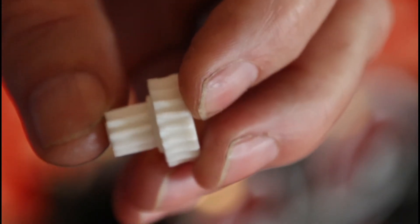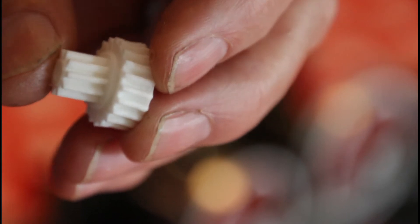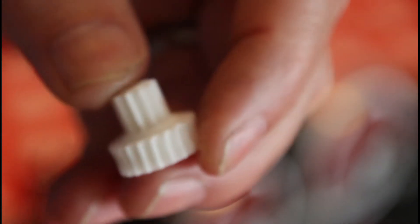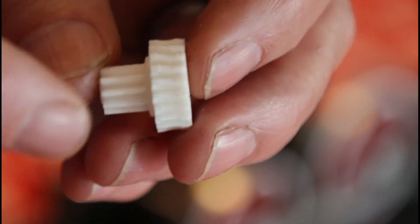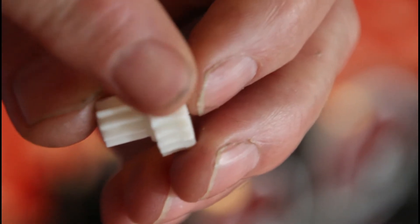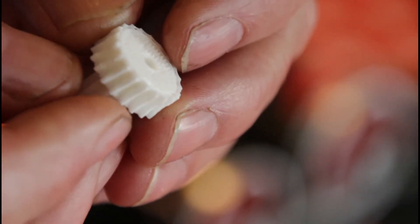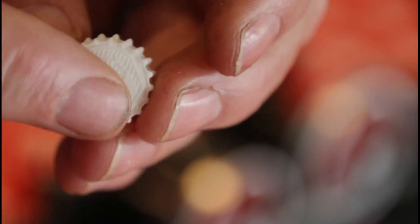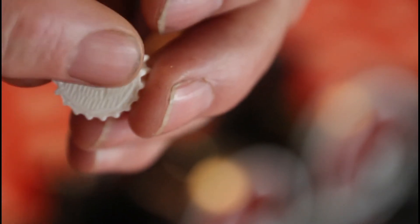It's an incredibly complex arrangement, and all right if you've got a rigid metal gearbox frame, but when all you've got is bits of plastic it's probably not a good idea. This gear was completely missing, so I 3D printed it — if you want a copy of the file just send me a message. It's quite complex: the teeth have to be helical and you also have to create a form for the worm wheel to ride in. Because it's 3D printed you have to watch the strength of the teeth, so the back and front surfaces are raised up so they just clear the worm wheel but provide strength to the teeth.